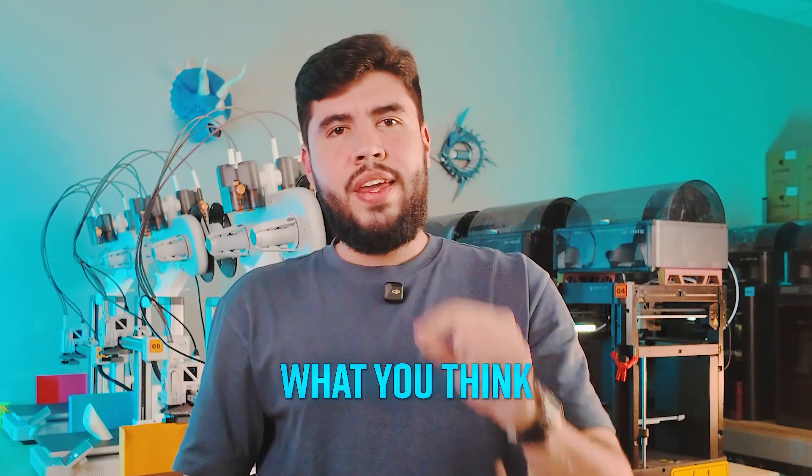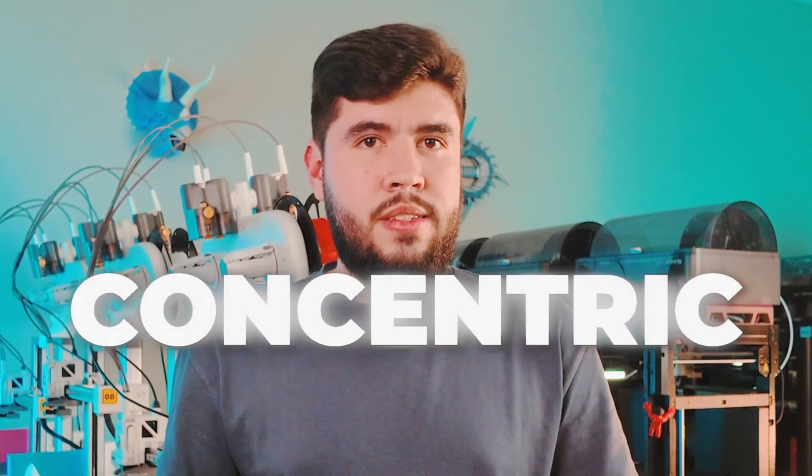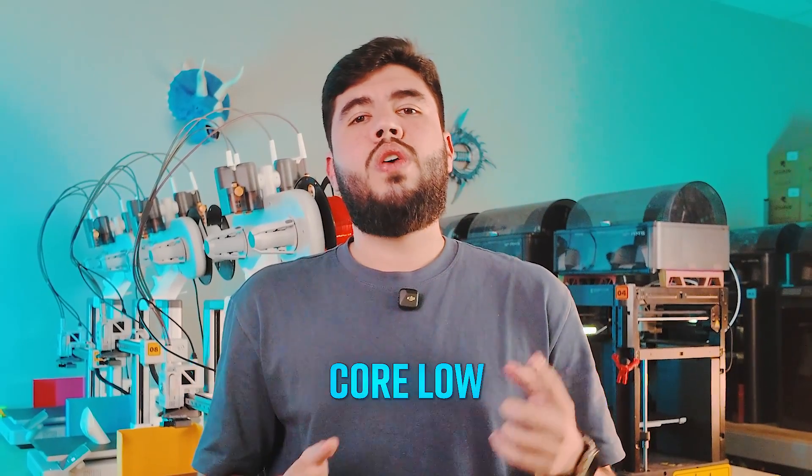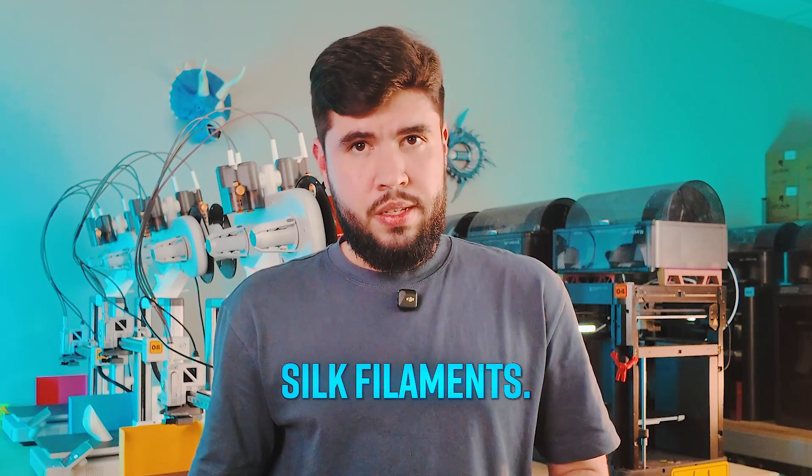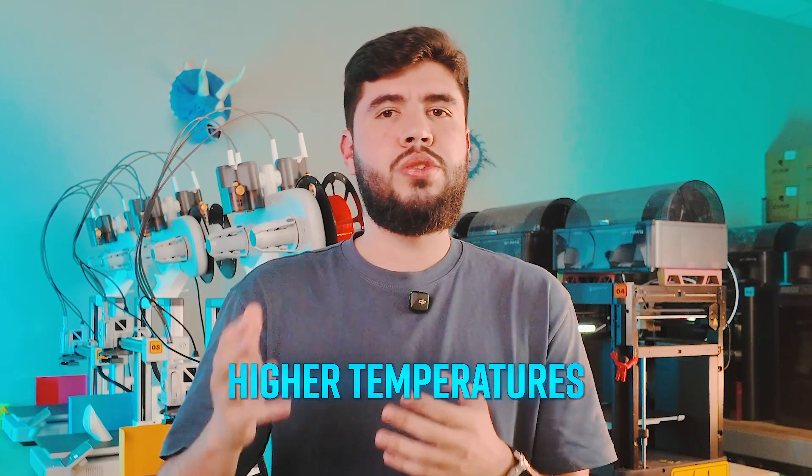Let me know in the comments what you think of this trick. To sum it all up, with well-wound filaments and a bit of test printing to find the right direction, your dual-color prints can look absolutely amazing. Just remember, most dual-color filaments like the STL Flix ones are also silk filaments, so they require slightly higher temperatures to print well. If your goal is maximum shine, reducing your print speed can help boost the gloss finish. Thanks for watching — happy printing!